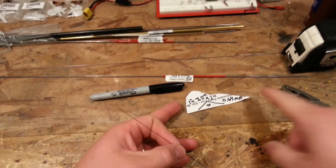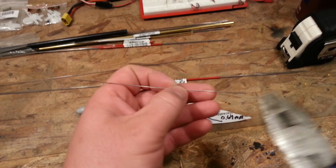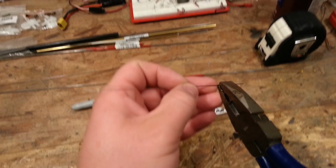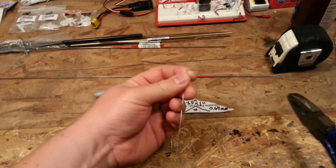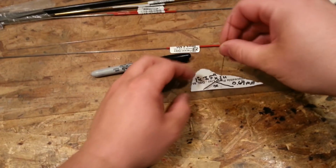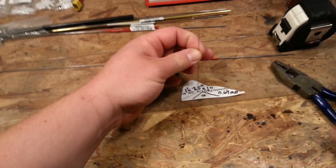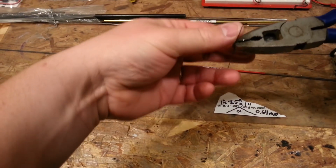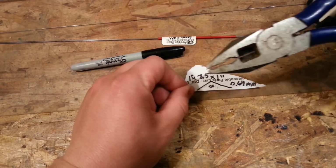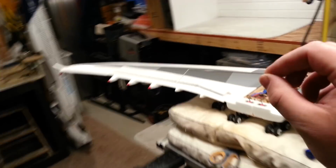So now I also drew the angle. Okay, see this angle here, guys? That's what we're going to do on this. Okay, so now we just need to take our 1 inch mark, and we'll go ahead and fold it at 90 degrees, approximately. Maybe a little bit less, maybe a little more. Probably not super critical. And then that becomes this angle here. This is fine, and then this one needs to make the other angle. And that's how you tension the spring, is by making it at this approximate angle, okay? It's hard to see on the camera, I bet.